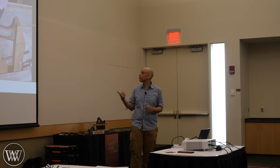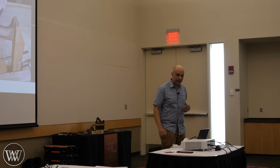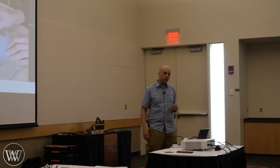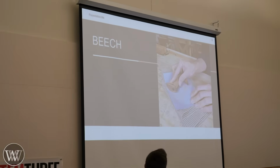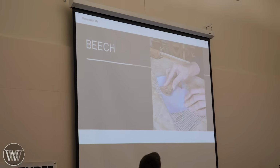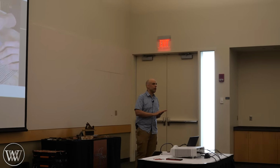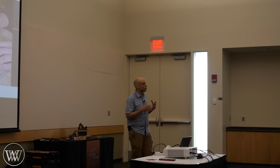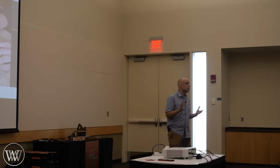And I find a nice sharp card scraper followed by a little bit of sandpaper does a great job getting rid of that old finish. And then if you want to sand, which I usually do, and I want to sand with the grains so I don't get any of those lines, it can be very easy to get flat spots on that shape that you want to keep nice and organic, not just for the way that it looks, but you also want it to feel good in the hand.